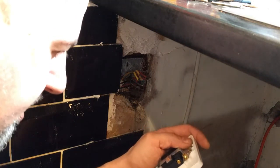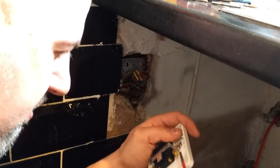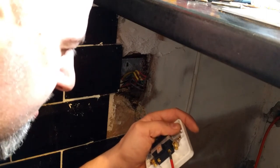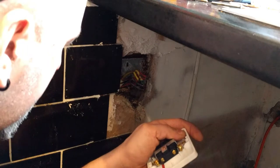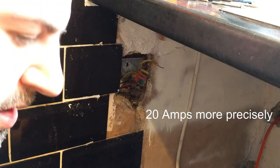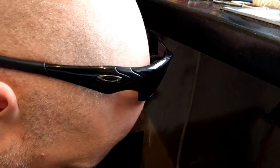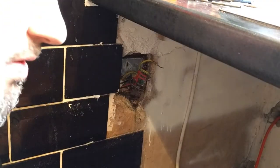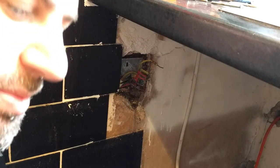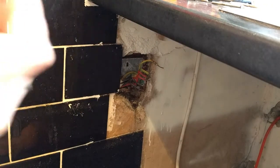They're overloading that socket or that plug, and very often the fuse won't go — because the fuse is rated, it's not going to blow at 14 amps, it needs a lot more current to burn. So because it didn't burn, if you have that socket keep working and drawing like two or three extra amps constantly, it gradually starts melting — and that's what's happened.